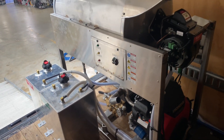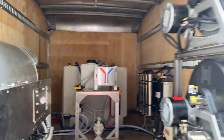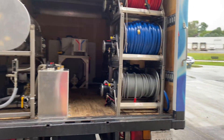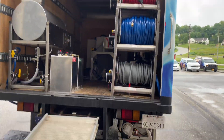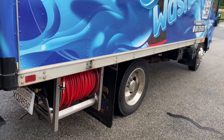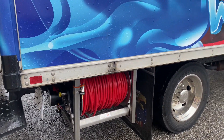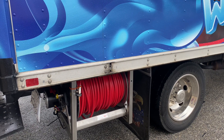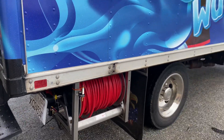Let's give you a better look at the pressure washer here — that's an 8-gallon-a-minute Water Dragon with a stainless steel frame. For the water-fed pole system, because we're limited here with access and already have three hose reels inside, we couldn't stack another one. So we came outside of the truck with our hose reel for the water-fed pole system. This one is just mounted on the underside of the truck and holds 300 feet of 3/8" hose that you can drag around the house and hook up to that ball valve with your water-fed pole to clean windows.